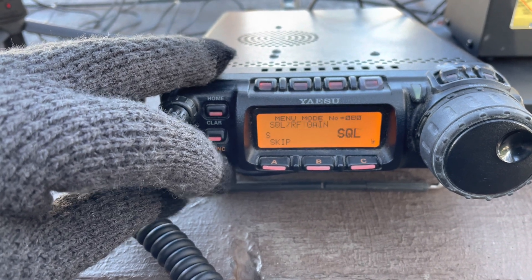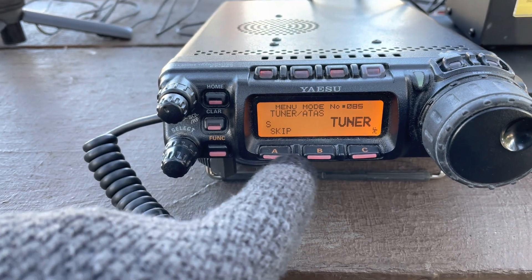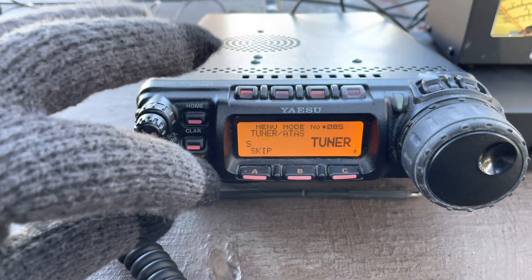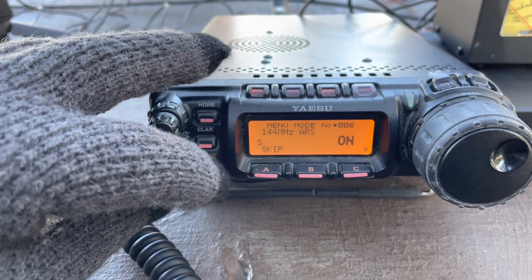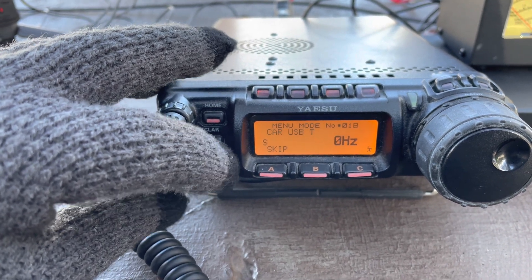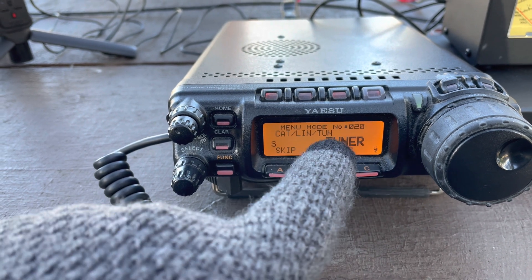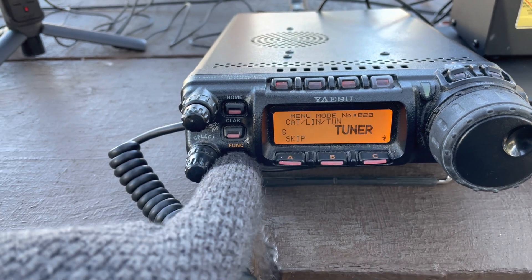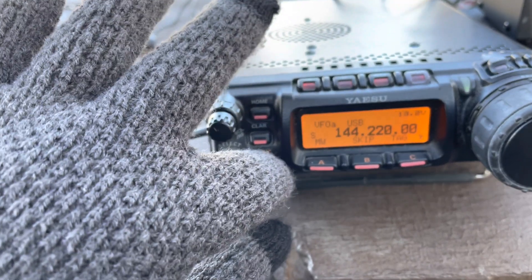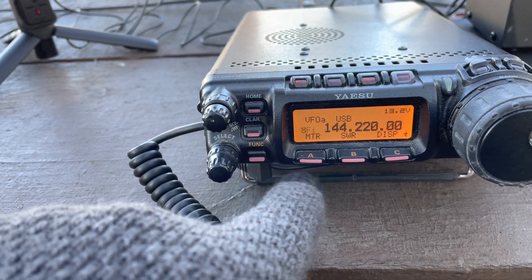Now I'm trying to find the tuner menu — there it is, number 85, 'Tuner.' If you hit some of the different functions it'll go to ATAS, which I think is for a tuner that comes from Yaesu, but you need this set to 'Tuner' on Menu 85. There's another menu at the beginning — it asks if I'm using a CAT cable — and the tuner there should also be set to 'external.' Then if I hold the function key down it returns to the radio. Briefly pressing the function key brings up a short menu and I want to be in the SWR display.